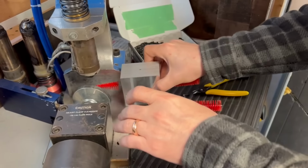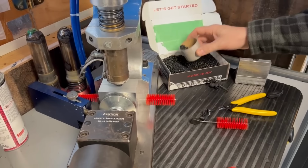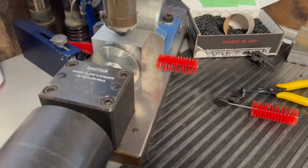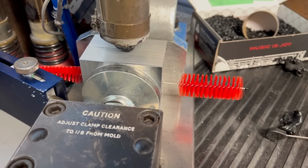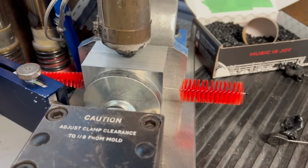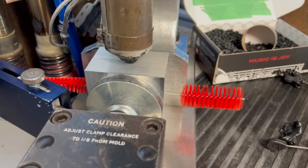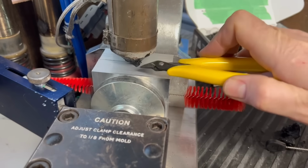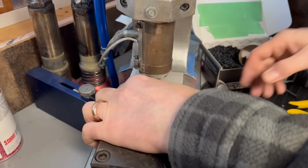Yeah, right. Let's turn it around this time just to see if anything happens. I wonder if that's what caused the leakage from the top, which may have started before. Well, I'm going to go back down. Our pressure, when the compressor recycled, went up to about 75. So that was a lot of pressure for this material. I'm going to go back to a 2 second inject since it seems to be going really fast. And we're at a good temp. Let me clear off the schmutz. We're still good there.